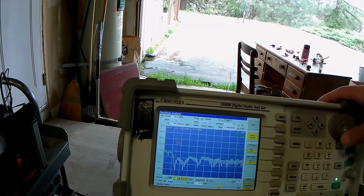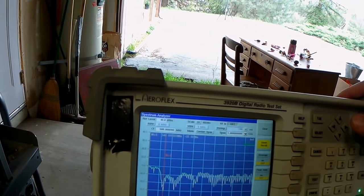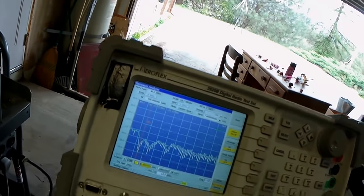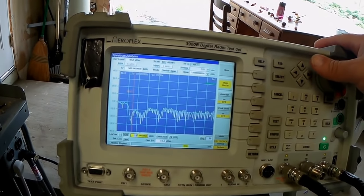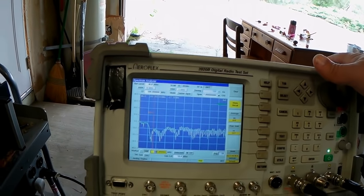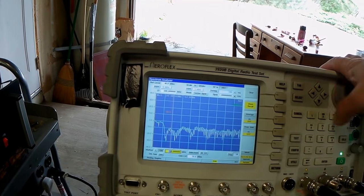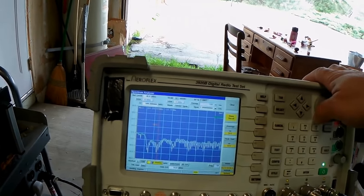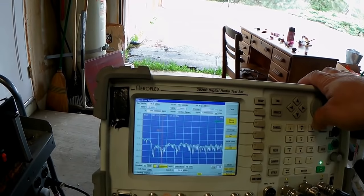As a six meter antenna it's really not the greatest, but it would spare your transmitter if you decide to transmit on that. Where it's really kicking ass is in the 150 megahertz range. Right there at 140 is the ham band and we're getting minus 25 return loss, which is kick-ass. You can hear a lot of fire departments running high band VHF. At 150 megahertz I'm still rocking minus 15; at 160 - that's getting into the federal frequency range - that's minus 17 dBm. At 220 megahertz, the ham band, you're going to do really well at minus 20.